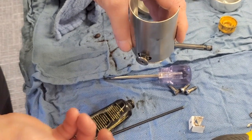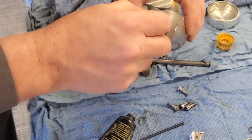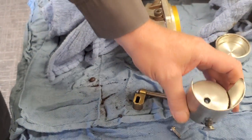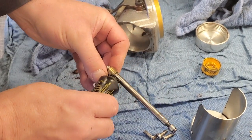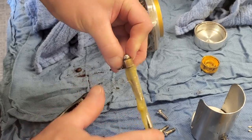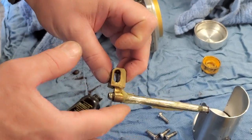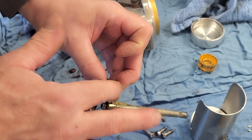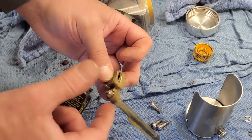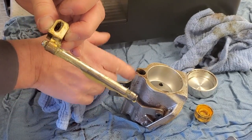We're not compressing the bolt all the way in. We also want to make sure that the ball is not protruding through the shaft hole. Just go ahead and get the lubrication that came through there and rub it around in the shaft hole. The next thing is to heavily lube our main shaft and get that spread all over. We also want to spread it around our top brass fixture here, which is where the tamper pin goes through. This part slides up and down on our main shaft assembly, so that's why we want lube around it.